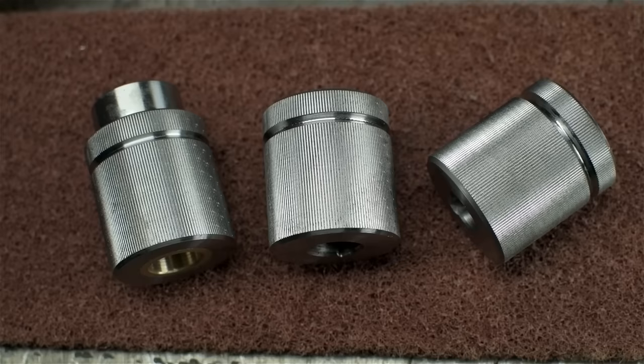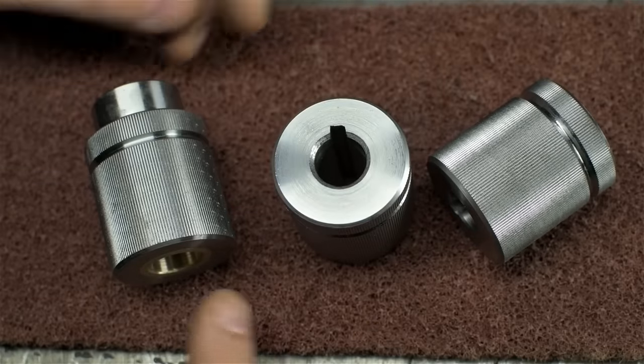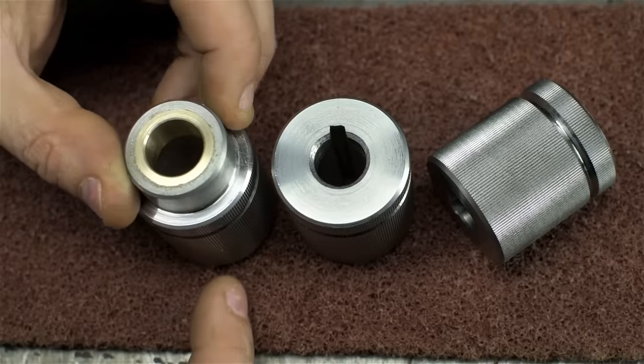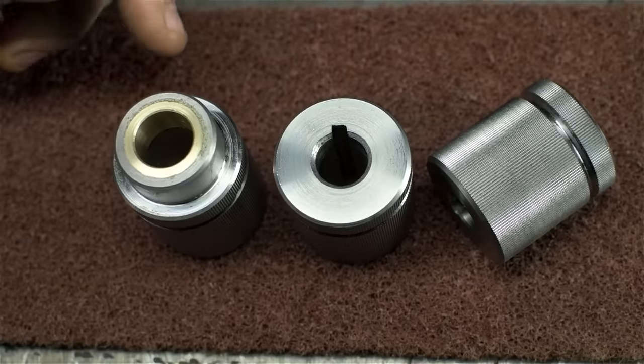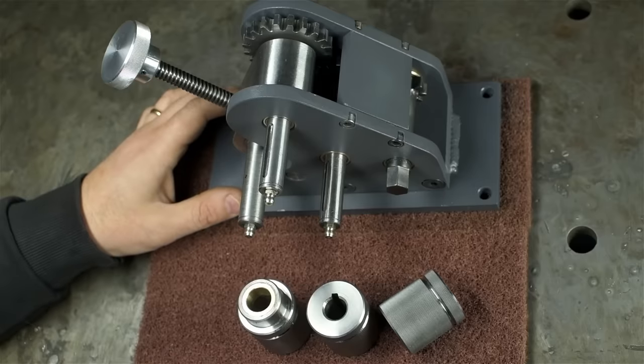And just like that, I've got the three rollers done. Two on the right are keyed, they're the driven rollers. And the oddball one on the left has an extra shoulder and is riding on bushings. They're just pressed in there and bored to size. Now, while you folks are watching me make these, I also painted the ring roller. That's what machinists like to call misdirect.